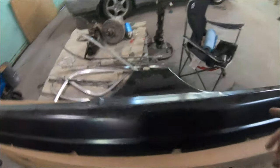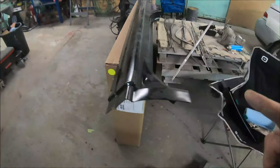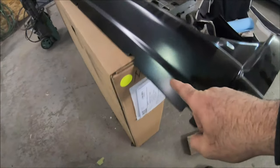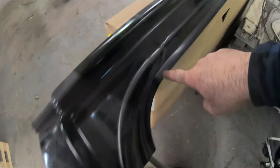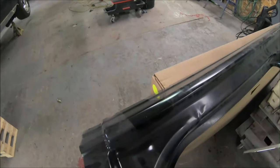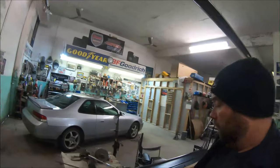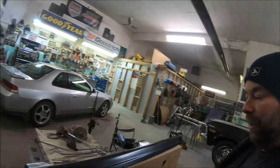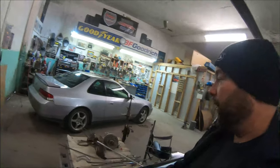That is the difference between an OEM style rocker and a slip-on rocker. The slip-on rocker just comes up and slips over this edge, whereas these OEM style go right into the door openings and into the pinch welds. So with these, the doors are coming off, the box is coming off — all that. Hopefully that all makes sense. I'm going to show you why I use this style and where I get them from.